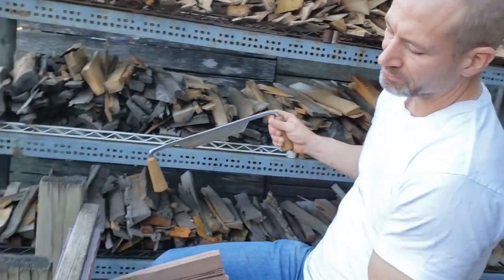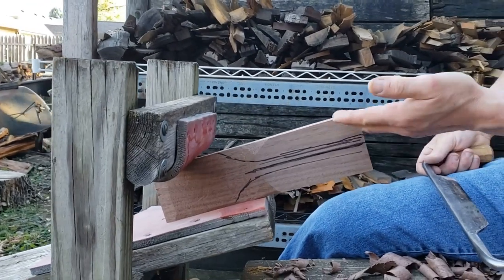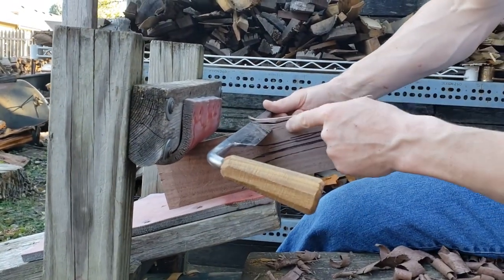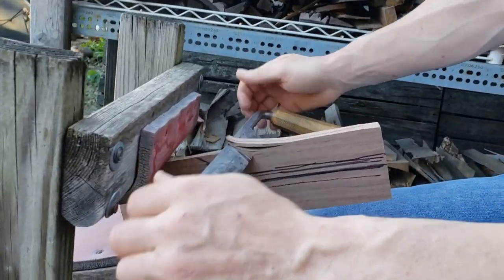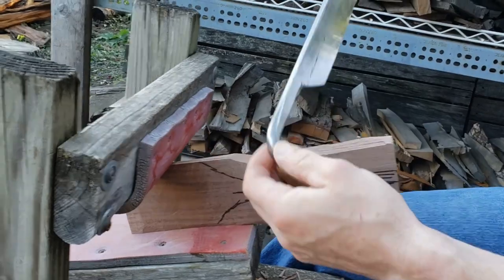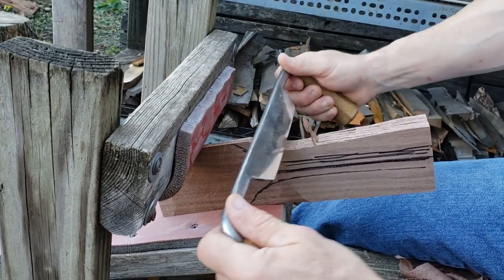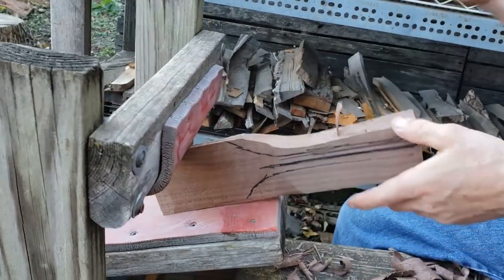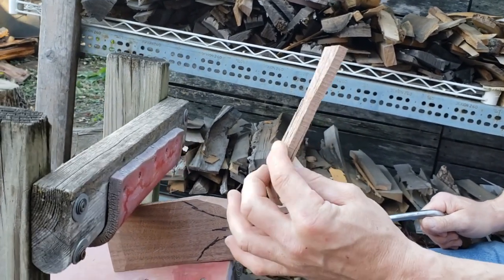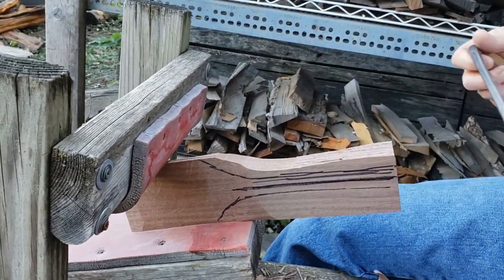Shaping the handle — I'm going to clamp that on edge and see how this wood behaves. If it splits predictably, I can save myself a bunch of cuts. I took a real heavy bite and it's starting to tear, so I'm going to crank my draw knife and see if that will just split off a big piece. That's why I build draw knives with stout frames — so I can crank on them without bending the tangs. I'm splitting off a large piece rather than taking 10 to 20 cuts to do the same thing. Saves time and saves elbow grease.